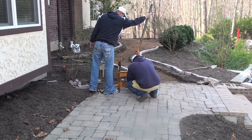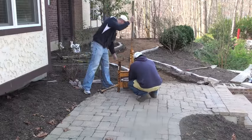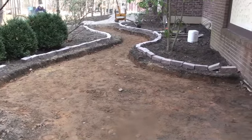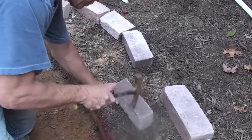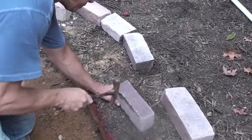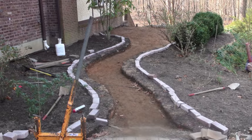This Gravel Lock job is going to be bordered with a manufactured concrete paver set in concrete. We split wall block to make our edging stone. We want this edge to look natural, so we are taking a chisel and roughing up the outer edge of the stones. Lay out all your edging stones to make sure you have enough.